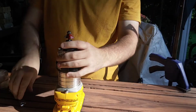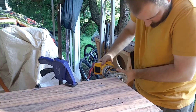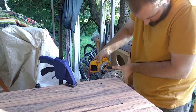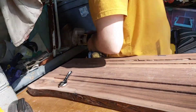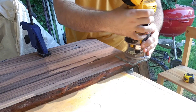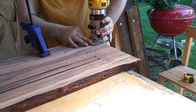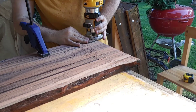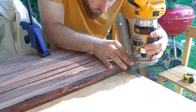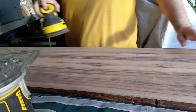When it's all said and done, I used a three-eighths bit in order to cut the grooves out. I didn't flush the C-channel — I ended up leaving it high because I wanted the little extra height. Normally I would route it so that the C-channel sits flush, but in this particular project I didn't. I'm rounding over the edge — after I did a 45 on the corners, I thought it was going to be a different look. It ended up kind of rounding over as I sanded everything, but I'm putting an eighth-inch round-over over the entire surface.